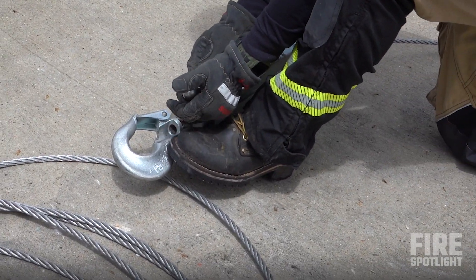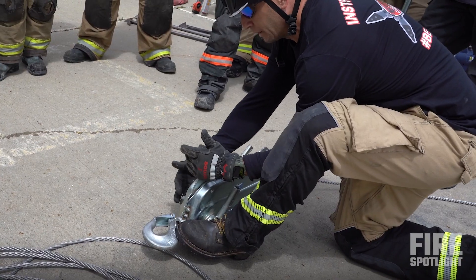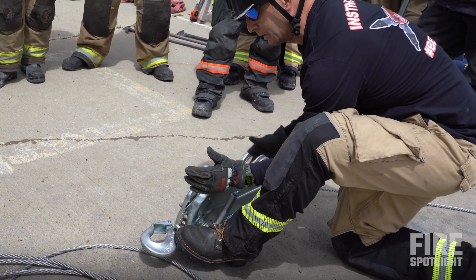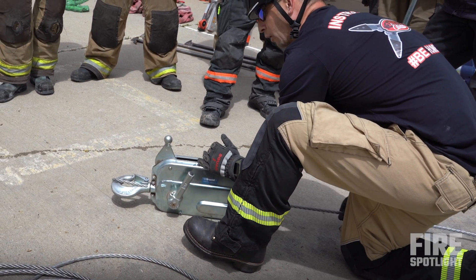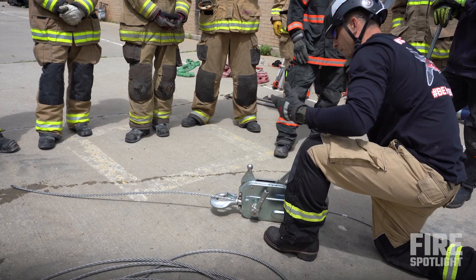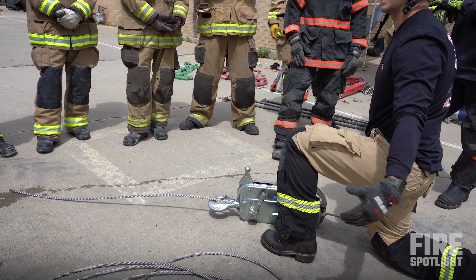I will then take a little tension. I'll push the pin in just like that. Pull that all the way up. Hold it. Release my finger from the pin. That will keep it in free spool. Bring it back to the way I want it to. Spool that all the way through. When I'm ready to lock it into place would be when I've taken all of the slack out of the system.